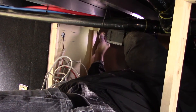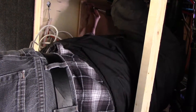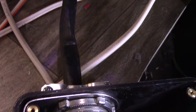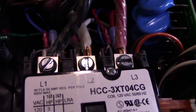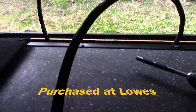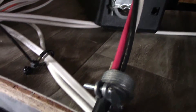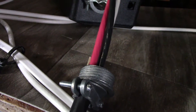We've got the piece of plywood in and Joe is screwing it into the studs — that's where we're going to mount the surge protector. The shore power wire is now coming into the input of the surge protector, and the red, white, and black wires are connected. Next, we have six feet of number six wire that we're going to connect to the output side, and I'm going to run it through into the circuit breaker box in the mid bunk.